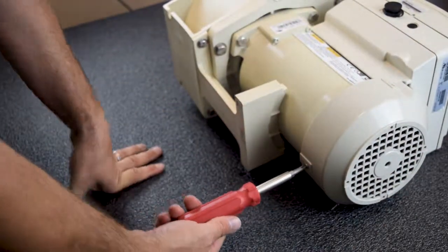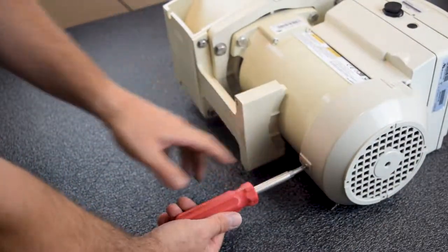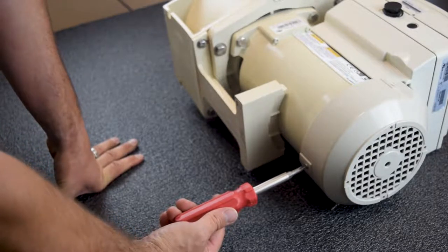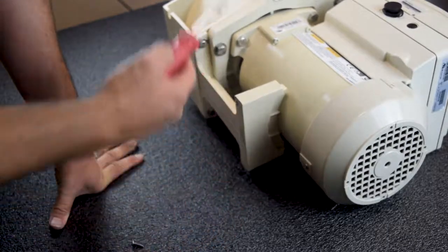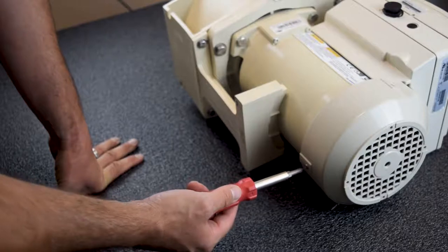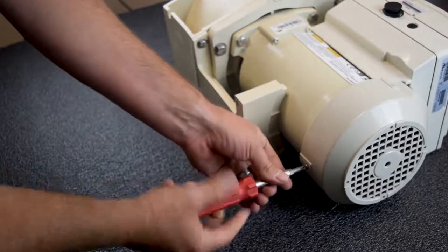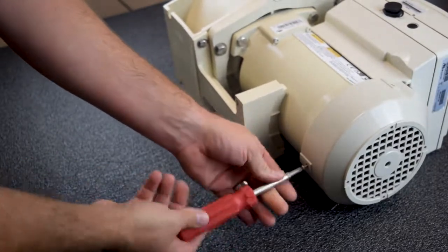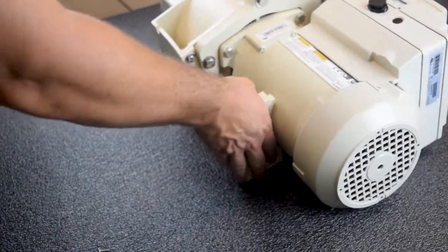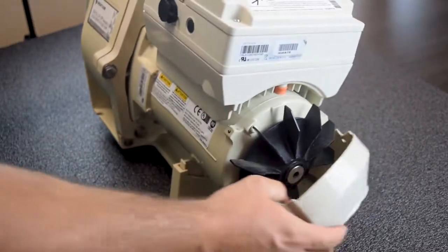As you can see, this is your ground level. Getting this one out would be pretty hard — you'd have to get an L-wrench with a screw tip on the end of it, which might be a little difficult. But if you put unions on your pump, you can take your pump off at any time. We always recommend putting unions on both the suction side and the return side of the plumbing of your pump so that way you can service your pump at any time. Custom Molded Products makes a really good union called a high temp union — we really recommend that.